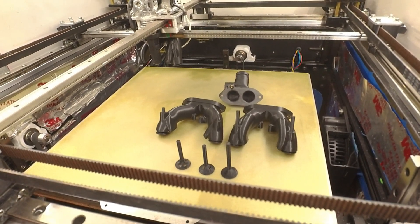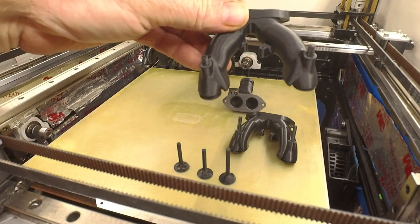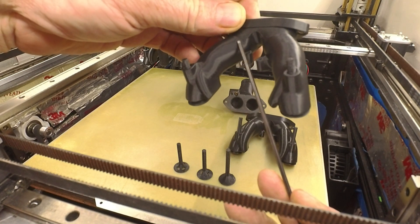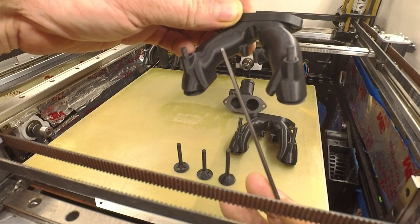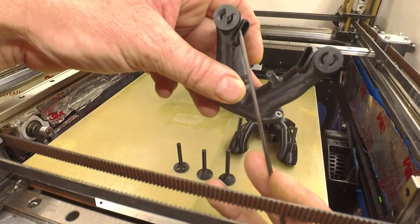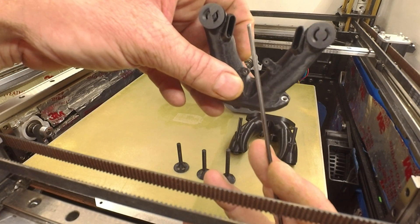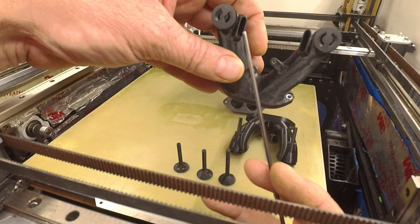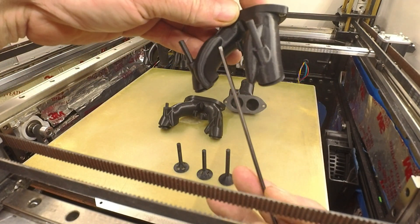I said I wouldn't do another PLA Benchy but I made some headway on this duct. Here's the old duct and the loft to the nozzle — air is coming here and it's not being channeled down, it wants to just run out the front. For this particular duct I moved the nozzle orifice further back because I knew the air was going to travel out that way, and that was my little temp fix. So I came up with another duct and changed these lofts here.